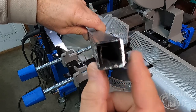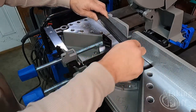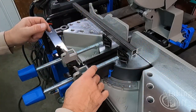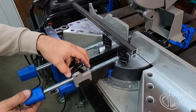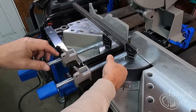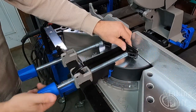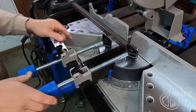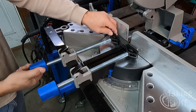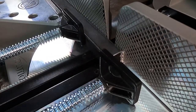First on the chopping block is some one inch square tube with an eighth of an inch wall thickness, and I'm going to clamp it to the saw using these front sliding clamps. These clamps are ratcheting, so they will go forward but will not come backwards unless you lift the lever. Once you get them into place you can tighten them down by turning the knob, which locks the metal into place.